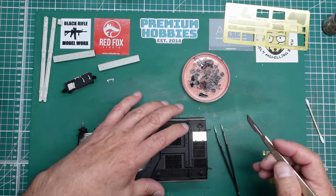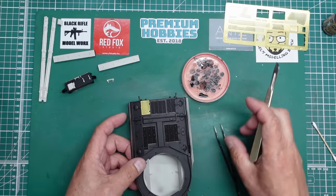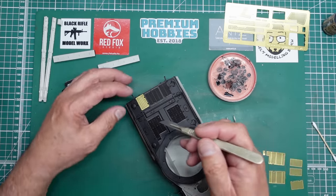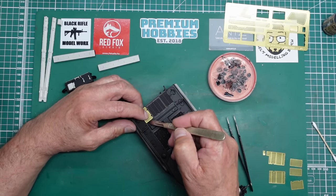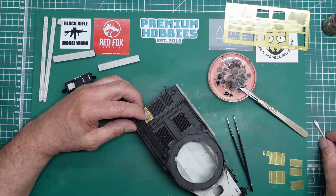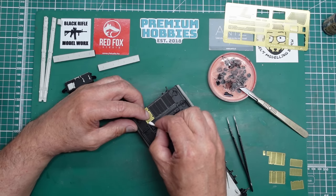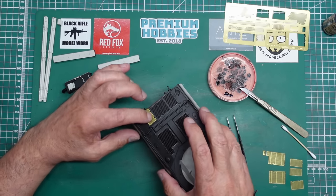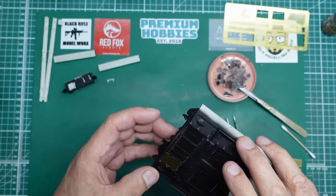And then just leave that for a few seconds. And then again, we can come on, the knife in the glue, holding the mesh down. I'm going to put the blade into the corner, just let the glue capillary under. This is why I wanted the glue to be thin, because it won't capillary if it's thickened up. I'm just wiping away the excess there with the cotton bud, and as you can see there, it gives you a very, very neat joint.